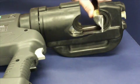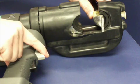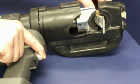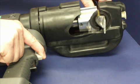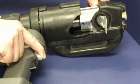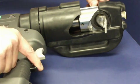The stationary head is opposite the RAM and does not move during crimping. To crimp a connector, press the conductor and connector combination against the stationary head of the tool. Squeeze the gray trigger to advance the RAM. When the sound of the motor changes, the crimp is complete. Press the black trigger to release the RAM.